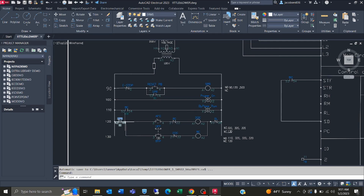On this first rung we just got it going into the AFC switch, then going into a BC contact creating an interlock so when BC or DOC is running, the other one cannot run at the same time causing any issues. Coming out of BC we're going into the DOC A1 and into the A2, which is tied in with BC A2, and they are both going into the overload. The next rung comes off the same connection point from the SPR going into the bypass, going into the DOC creating another interlock, then into BC A1 and out A2 tied back in and going into the same overload.